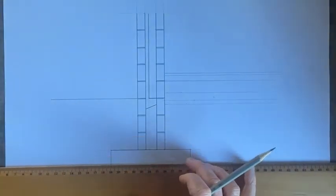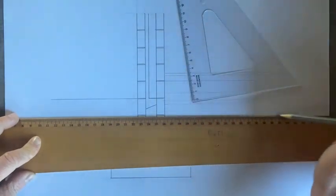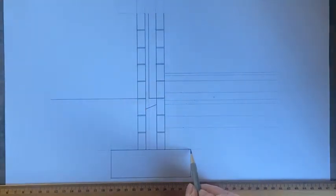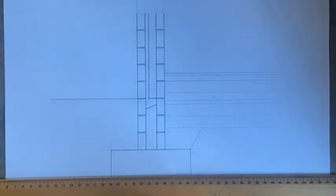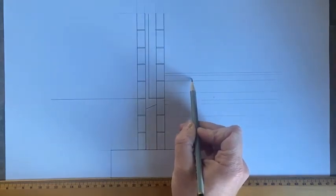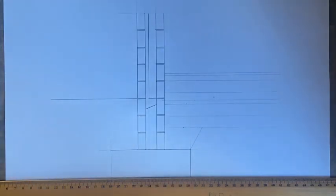Underneath that we're going to have hardcore. Each layer of hardcore we mark as 150mm, so I'm going to do two little layers of it. From the top right-hand corner of your foundation, bring a line up at any angle towards the right, just to the first line. So there are all my layers: flooring, screed, concrete subfloor, insulation, sand blinding, and all these layers here are hardcore — they go in 150mm thicknesses.